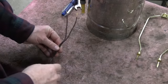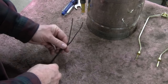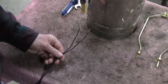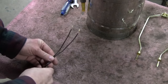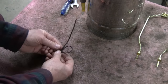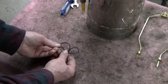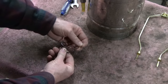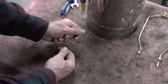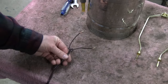I've already put the wire in, but before I shove it in I'm going to show you something down here — you'll be able to see it better from down below. What you have to do after you run the wire through is tie an underwriter's knot. It's a very simple knot. You take this wire and loop it, loop it behind the back, and this other one loops around the back of that wire. Send this one through there and this one comes through here. Then you pull it tight — it's like a bow. That's what's called an underwriter's knot, and it just keeps everything from pulling through.